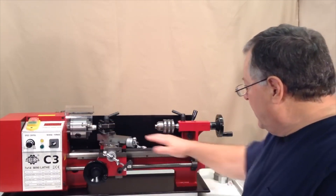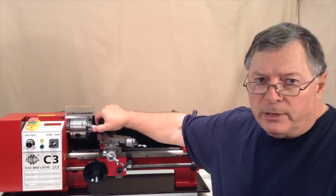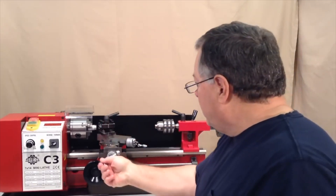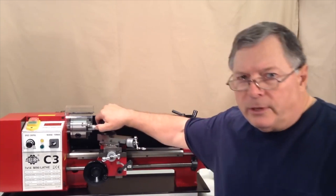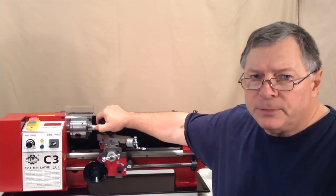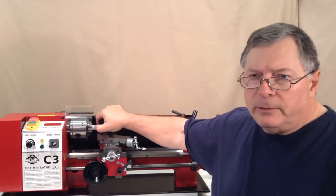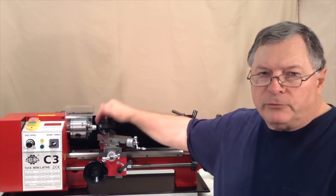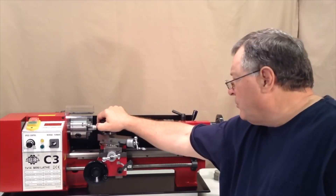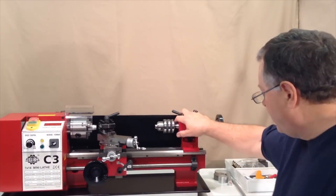The lathes are all quite similar in terms of structure but different in size and they have quite a few variations in features. So if you're thinking about buying one, you want to take your time and carefully compare the different vendors and the different sets of features offered. They're basically all scaled down versions of industrial metalworking lathes and with careful work and proper adjustment they're capable of precision down to about a thousandth of an inch or a little better, or about 0.02 millimeters. I've posted other videos that break down the different models by vendors in the US and talk about precision and capacity. So check those out before you make a purchasing decision. But let's go ahead and take a detailed look at this particular lathe and all its different components and features.